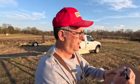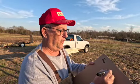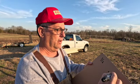So I've got to talk about the roof first because it's all intertwined anyway. I called the place where I'm going to get the roof panels from. They said I need a minimum of 3/12. It looks something like this. It's called a 3/12, and what that means is, for every foot that it goes out, it goes up 3 inches.